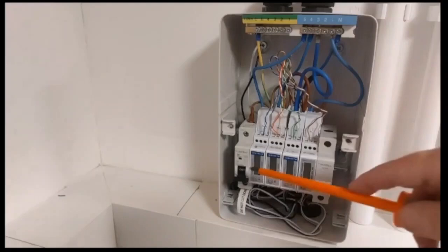Start at the meter and then work your way with a single Cat 5 or Cat 6 cable - this is Cat 6 in this instance - all the way through to the first inverter. In this case that will be inverter 2, then in and out of that inverter to inverter 1, which takes the grid meter in and out of inverter 2 onto the EMS.